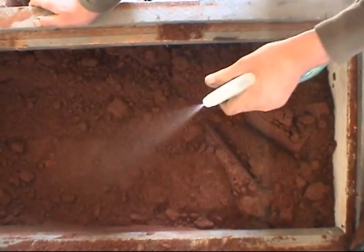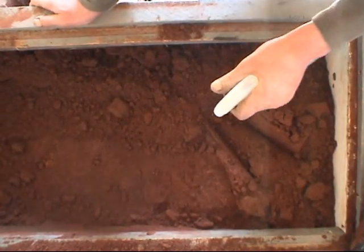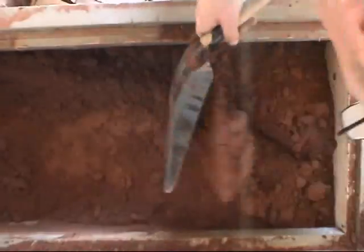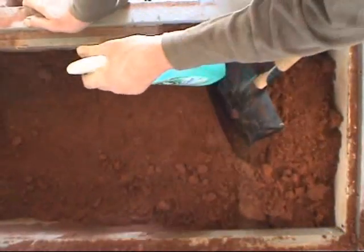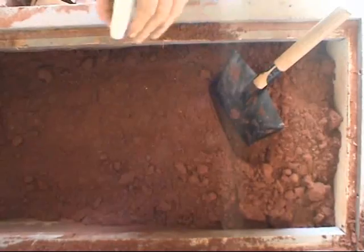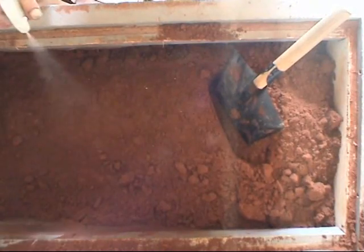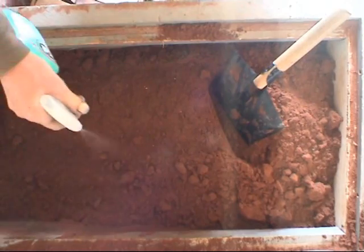The sand is not green in colour — it's sand-coloured. The 'green' refers to the moisture content of the sand. This sand has been used quite a lot and much of the water has burnt out of it. The moisture content is very critical: not enough water and the sand won't bond together; too much water and when you come to pour the metal it'll flash into steam, and basically the mold can explode in your face.